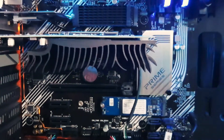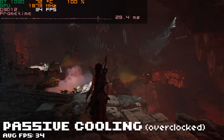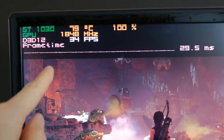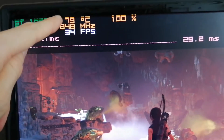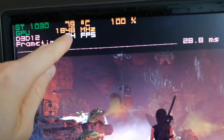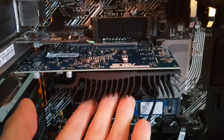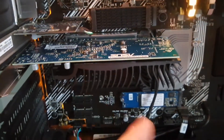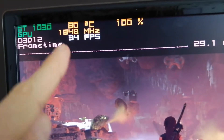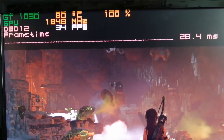Same thing on the passively cooled card — running the best stable overclock I could get. Out of the gate, the FPS was the same, but after running for 10 to 15 minutes, we've almost reached 80 degrees and it's throttling a little. It was at 1860 MHz and now it's dropped to 1848 MHz. The heatsink is actually really hot — when I touch it, it hurts my fingers. I'm curious to see if it fully throttles if I let it keep running.